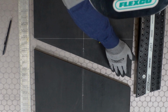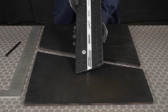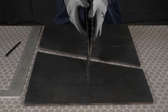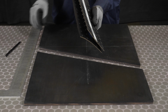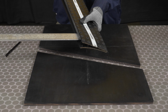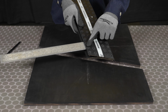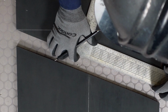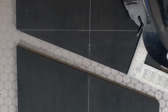Once the belt is cut, determine the distance to skive on each end of the belt. Note that the measurement will be equal on both belt ends. Measure from the spacer to the edge of the splice, or use the table on the back of the instruction manual to determine the distance needed to skive. Using multiple points, create a line that represents the distance of the skive on one end of the belt. Then repeat this process for the opposite side.